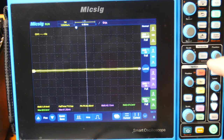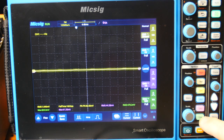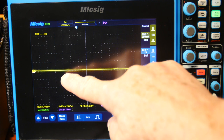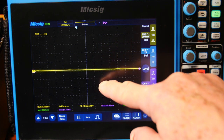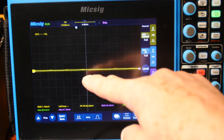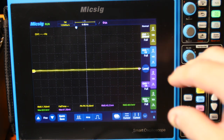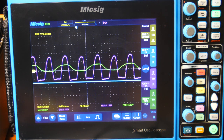In this shot we're going to look at the diode waveform. I've moved the differential probe — channel four, the green one — to look across the diode at 10 volts per division. Typically you'd expect to see the waveform go up when it's reverse biased, then come down as the diode turns on and it's flat at about 1.5 volts forward drop, then the AC waveform turns the diode off and you see the sine wave blocking portion.